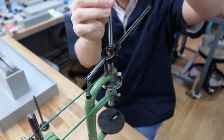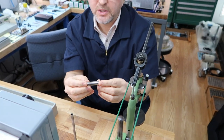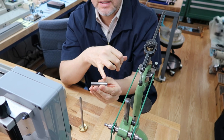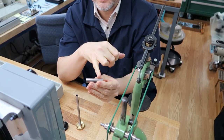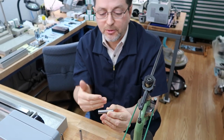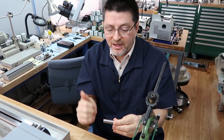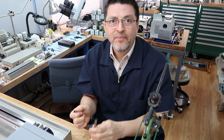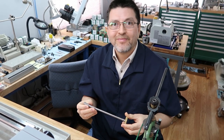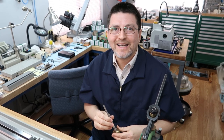Okay, so I don't need to touch this. This is perfect as is. I just need to go out to the machine shop and put this on our large lathe and do two machining operations. I just need to cut off about 3/8. I'll measure it exactly. Just face it to make sure it has a nice smooth face. Then I'm going to give it to Lance, and Lance is going to deburr it, clean it up, and make sure it's all perfectly cylindrical and flat. Then he's going to give it back to me, and we're going to bring you back here and test it with you. So another machine being rebuilt, in this case fully rebuilt, will be off the list and ready to help us in the future.